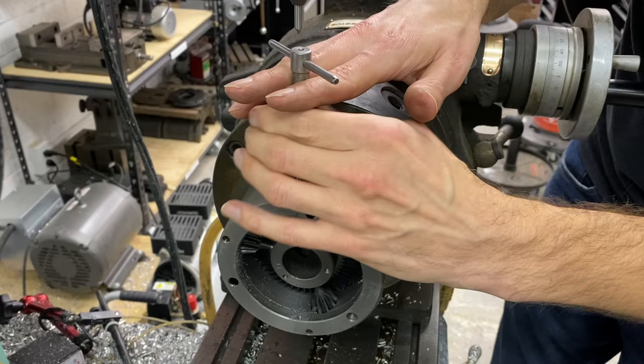This is a great thing to do for small hobby machines. If you've got one of the little bench-top lathes with a couple of different chucks, making it set true gives you a lot more capacity for precision work. Even if you have a collet chuck, a good one is usually repeatable easily within a thousandth for reclamping parts, but a lot of those are not adjustable.